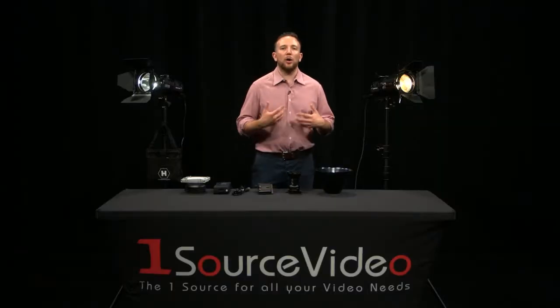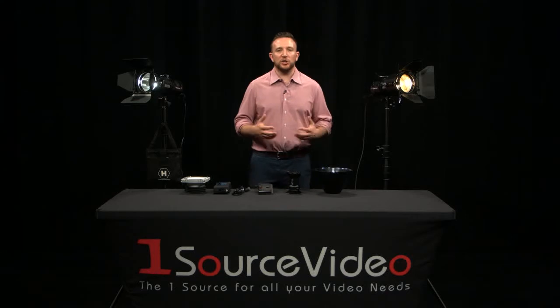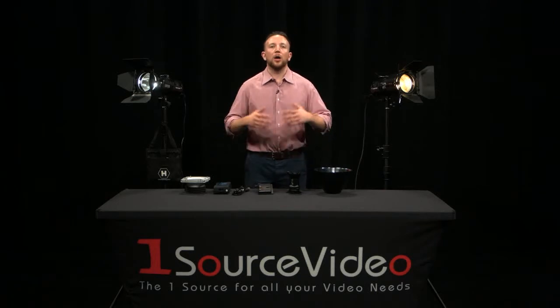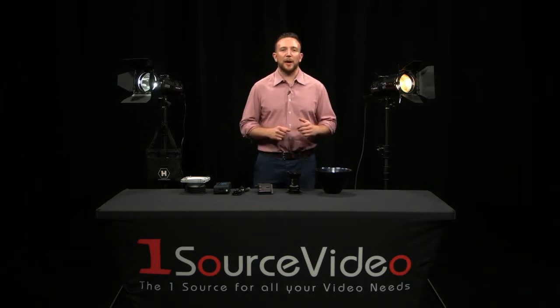The Wasp 100c is what we at Hive Lighting call an Omnicolor LED. An Omnicolor LED combines all of the white light color quality and control you would expect from a bicolor, giving you a broad range of white light, along with all of the various color control and fully saturated color you would expect from an RGB unit. We achieved this with five different fully saturated color chips: red, amber, lime, cyan, and sapphire. This gives us a very full spectrum of light with a huge white light range from 1650 Kelvin all the way up to 8000 Kelvin, along with fully saturated colors allowing us to achieve any color in the rainbow.